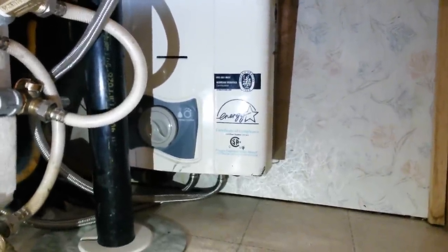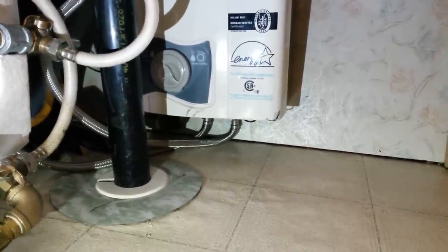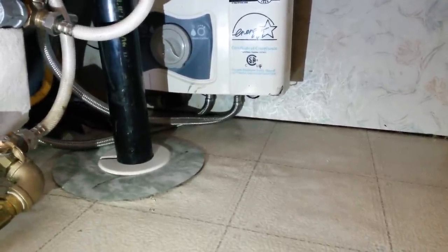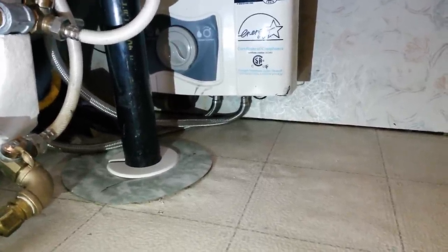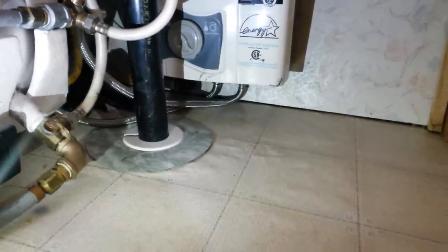I've been using the same Excel water heater for over five years. I started with the dyno version but the battery inside went bad, so they sent me a new one no questions asked — the battery-powered version that runs on 2 D batteries. Those 2 D batteries last about six months, it's incredible how little power it takes. But I got tired of crawling under the sink, so I cut the end off a Motorola 5-volt USB power adapter, ran it into the spade connectors, and removed the battery entirely.